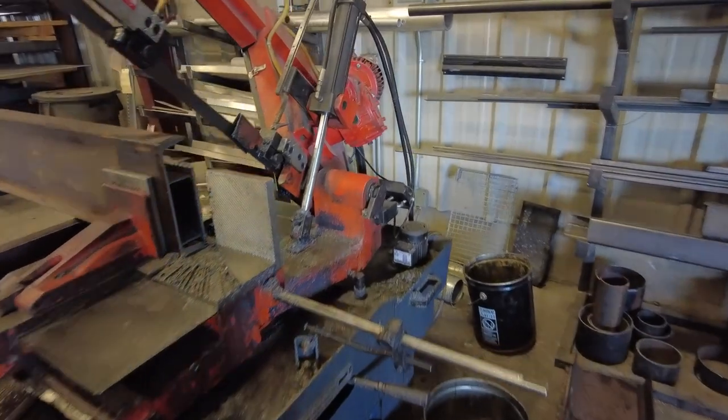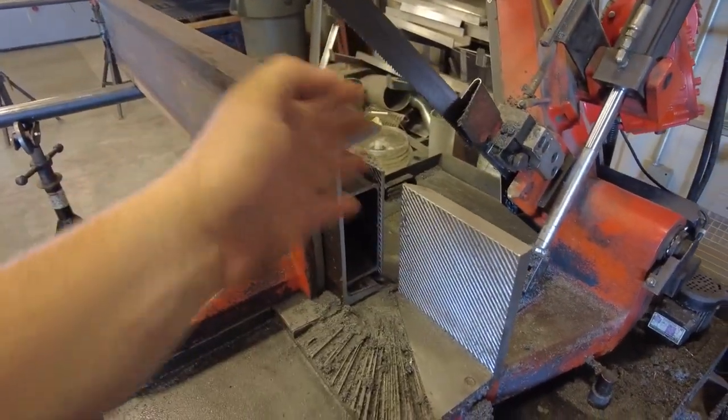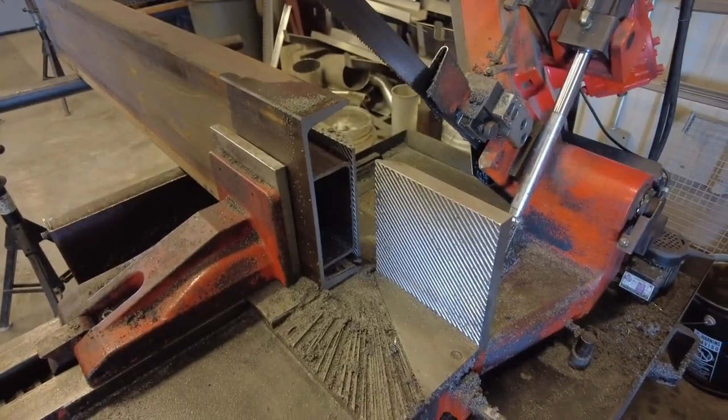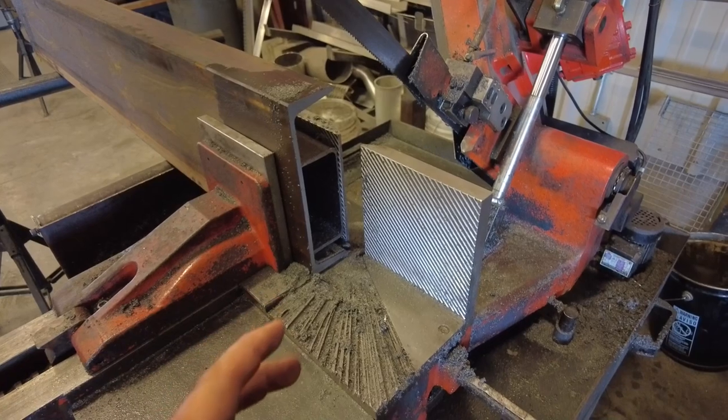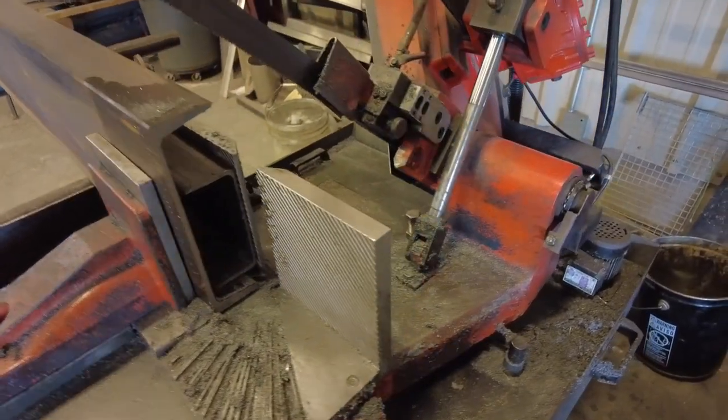And before beveling, would just take forever. And I would chop up two or three pieces at the most in my bandsaw right here. I've got another project in there right now, but this bandsaw, I can turn it to the angle I want the bevel, and it makes really nice straight cut bevels, and it's the fastest way that I could find to put clean bevels on, other than milling each piece, which just would take way too long.